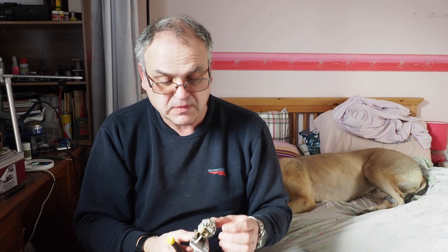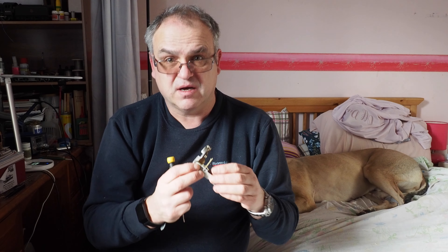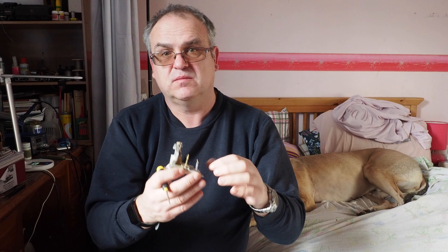There are a number of spares and they are different. The injectors have got a shorter handle; the brake blower has a longer handle. Unusually for a passenger locomotive, the A8s had lever reverse. There is a witness mark on the casting - all you need to do is drill that out. It's a rectangular witness mark. Just drill it out twice and then use a sharp blade to cut the white metal away so that the extension of the lever at the bottom of the casting actually fits through the hole. The brake standard at the back is pretty straightforward - again it's a 2.4mm hole for the pip on the end. Put that through and solder it from below.